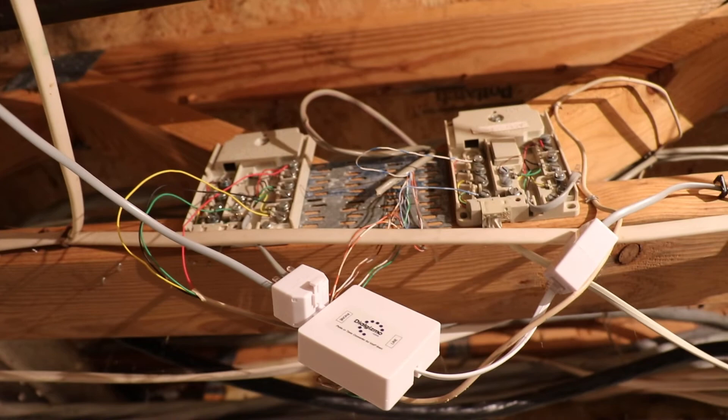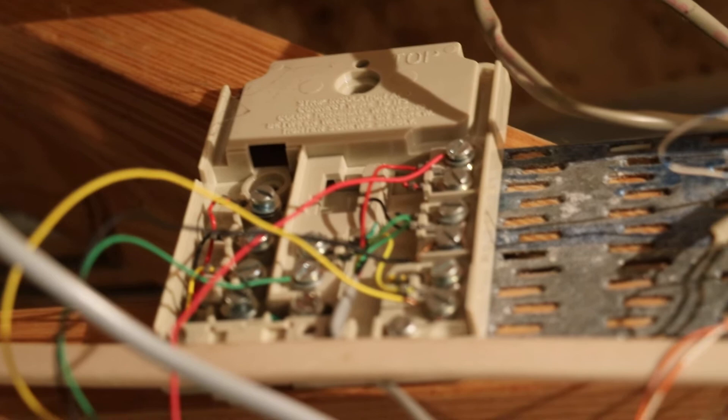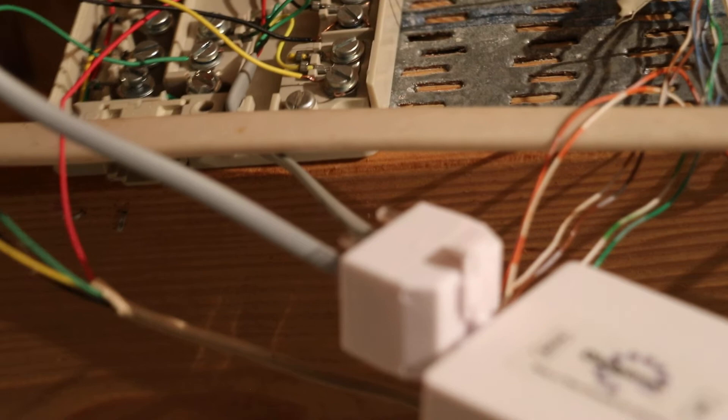This is basically a bonus — this is how I got my phone jacks to work again. See that there? It's basically two converter boxes if you think about it. Those terminals there convert that into a jack, and those posts right behind those wires turn that into a jack. But since I have two of them, I was able to separate them. So that's the incoming wire right there. All those colored ones go nowhere. Those two convert that to that, and that gives me my phone. That runs back up into my phone jacks via this wire here. And this is the internet there — the blue and that stuff.